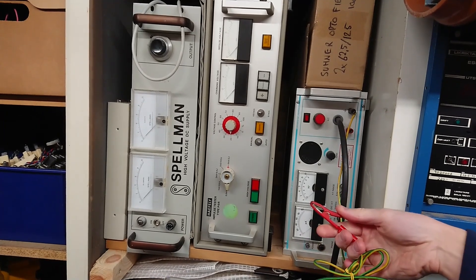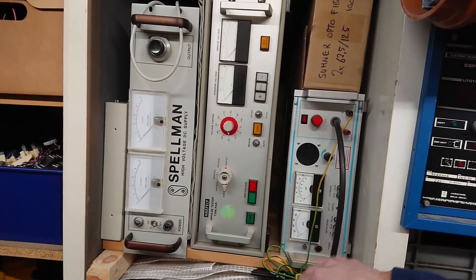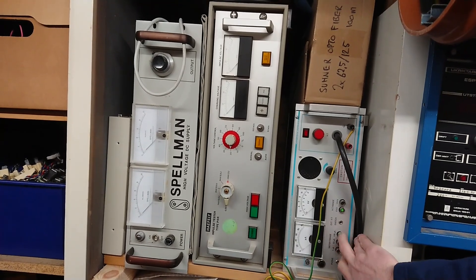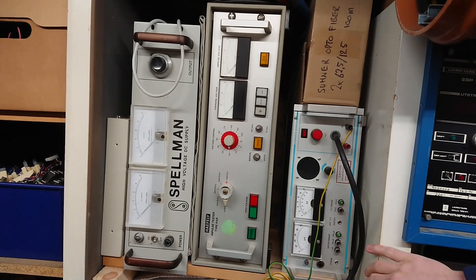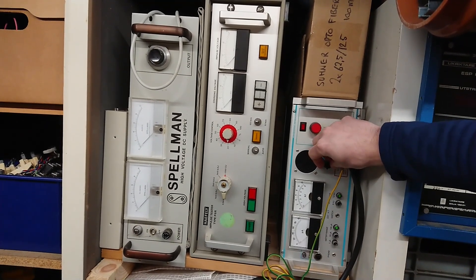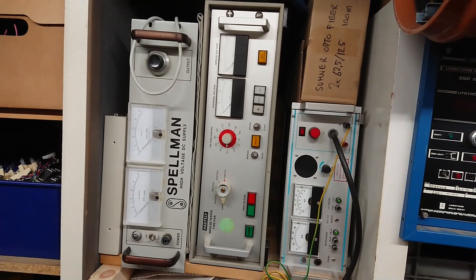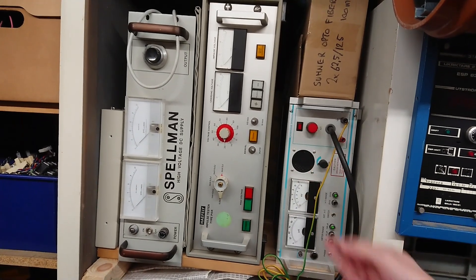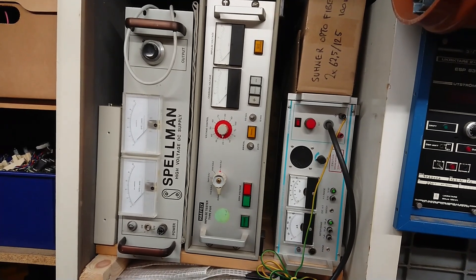You simply clip this onto some inner core cable, and you have a meter range of 1 microamp, 10, and 100. You can choose between 6 kilovolt or 20 kilovolt. It also has an audible amplifier built in, so you can both see the leakage current through the insulation and hear audibly the faults in the cable — when the spark can jump through, you can hear it in the speaker.